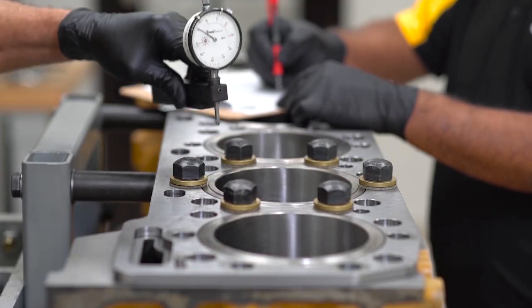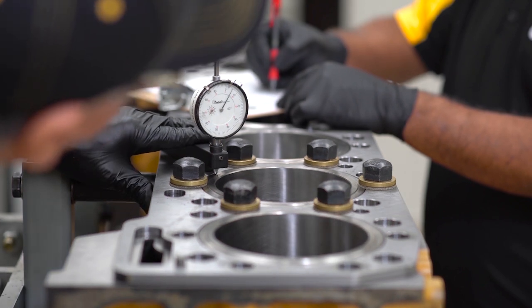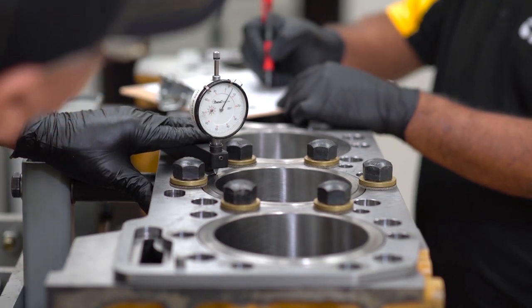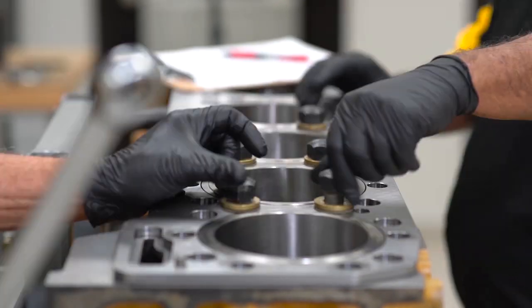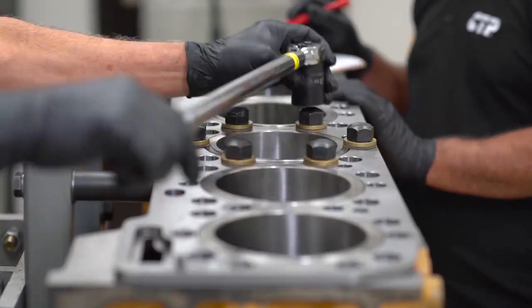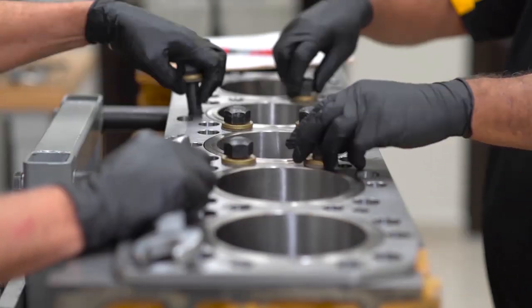The technician uses a projection checking tool. Here the dial indicator is measuring four thousandths of an inch projection. This is recorded and the hold-down bolts are moved over to the third cylinder for measurement. The liner is checked in four locations around the liner, and each measured value is recorded on the liner worksheet.